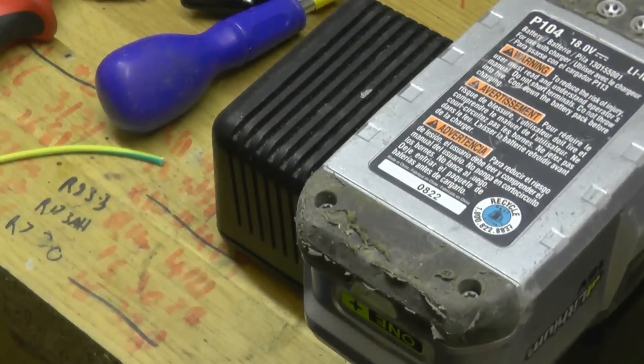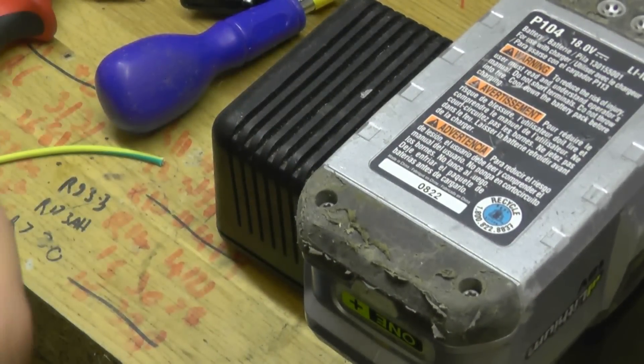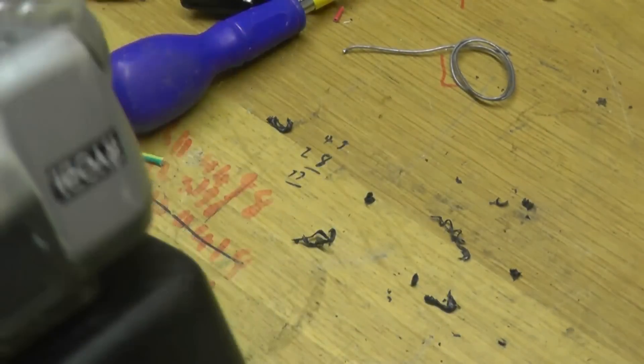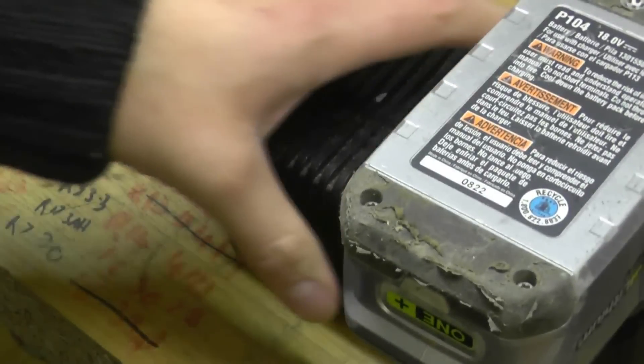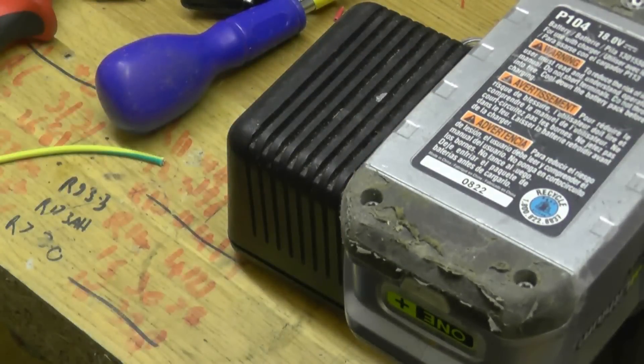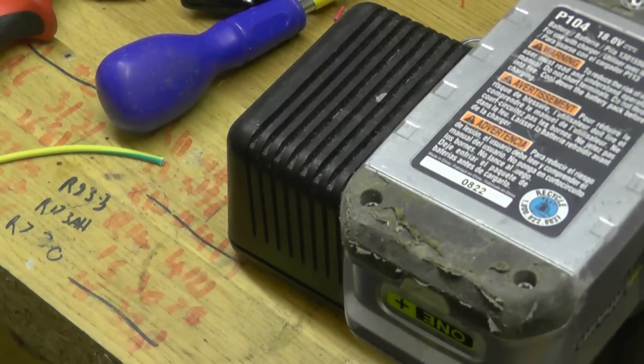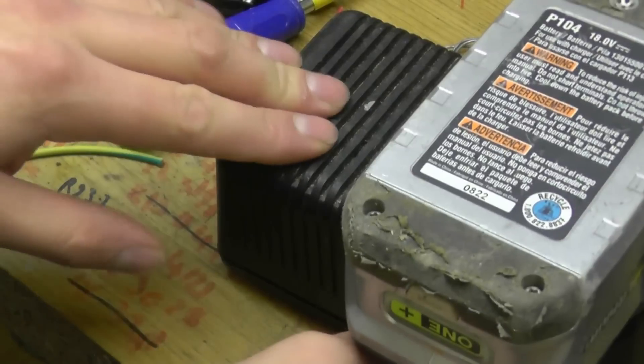So yeah, I'm going to use this for my soldering iron for now. I do have plans to add other things — USB ports, and I'm going to put a 12 volt socket on it as well, because I have certain low wattage things I can utilise on it. But obviously the buck converter in there is only 3 amp so you can't really put too much on it. That'll do for now — thank you very much for watching, please subscribe, comment and rate.